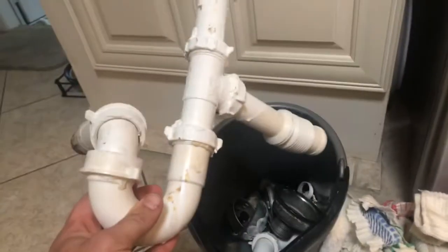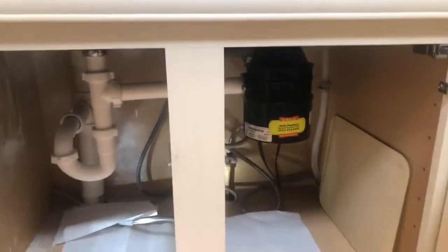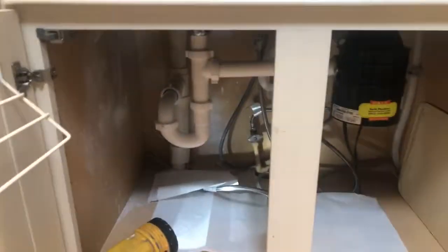Fred Burrell, Swift Plumber's video report for a kitchen pipework repair. They had this coming off the disposal, and they had it double-trapped — I've got a picture of this. It came down an accordion trap, over across another trap, all kinds of stuff. We just cut it all out of there and redid it.